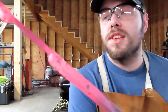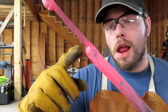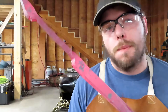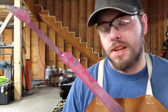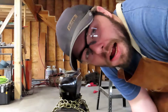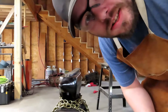We got this drawn out fairly well. I'm going to set up a hardy cut tool or hot cut tool to slice this, then start rounding it up, and swap from holding the raw stock to an actual set of tongs. Just realized I haven't finished my hot cut tool, so I'm going to take this jackhammer bit I bought for about fifteen bucks and use that to slice it off.